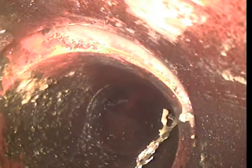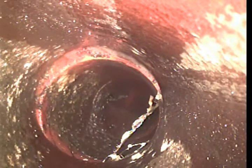You can see here — here's a pretty good offset. That offset seems to stair-step up. Stair-stepping up is much less preferable than stair-stepping down. Stair-stepping up impedes the flow of water, and we use gravity — a quarter-inch drop per linear foot — to carry our wastewater out to the Spokane County sewer.